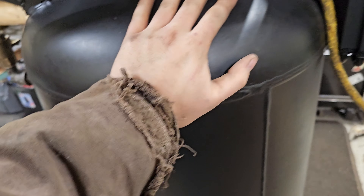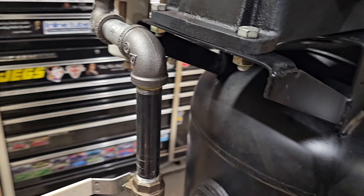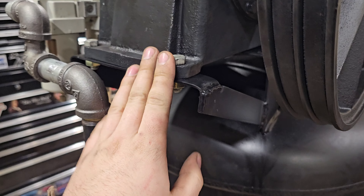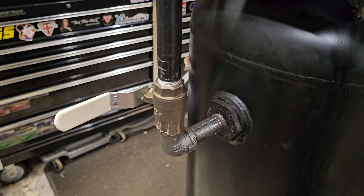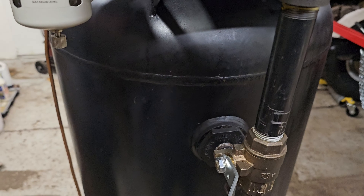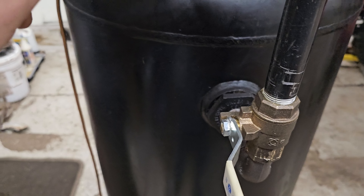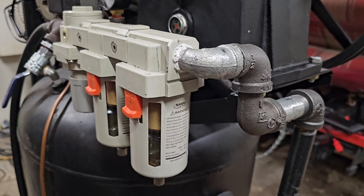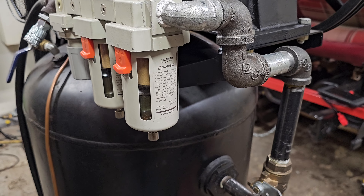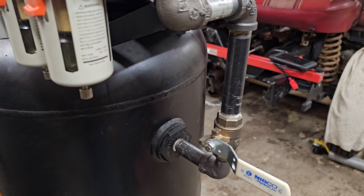The tank I paid about $200 for. I had to build some brackets to extend the base and it's super solid — there's no vibration at all. Then I had to change my pipe layout so I could still have my valve. If I was smart I would have just run the valve right off the tank and run copper pipe up to the dryer — the receiver dryers and regulator system. But I didn't do that; I stuck with the black pipe.